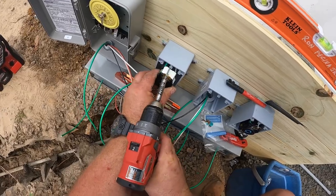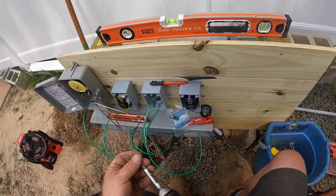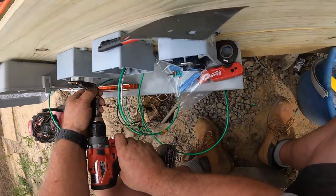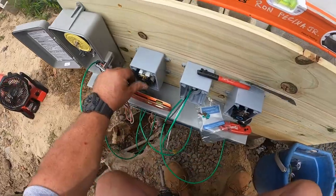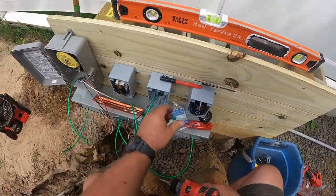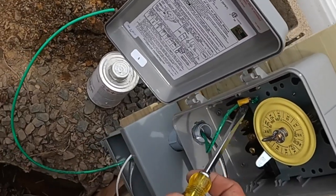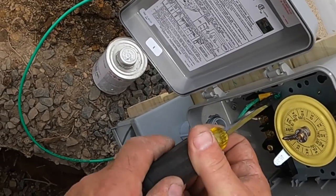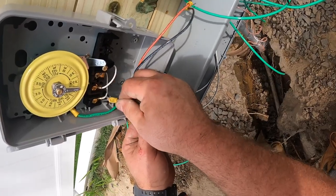This is for the pool filter — it's also a twist lock connector. What that means is it won't be able to vibrate out of position. When you push the male cord body into this receptacle, you turn it to the right and it locks in position. I'm not sure if it's required anymore for swimming pools, but I'm in such a habit of doing it that I just keep doing it — it's a better install anyway, and safer.